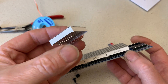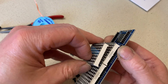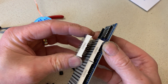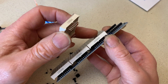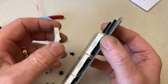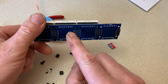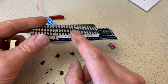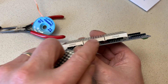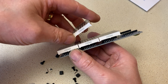One quick point — the LED matrices are in sockets, but you can get them the wrong way around. Luckily Banggood or the manufacturer put printed numbers on the end. I suggest you don't take all these out together otherwise you may get lost. I took one out to fit the socket — I'll refit it but I need to take the two middle ones out to get access to the back of the holes to mount the Pi. As long as you keep all the writing the same way round, you know you've got them right.